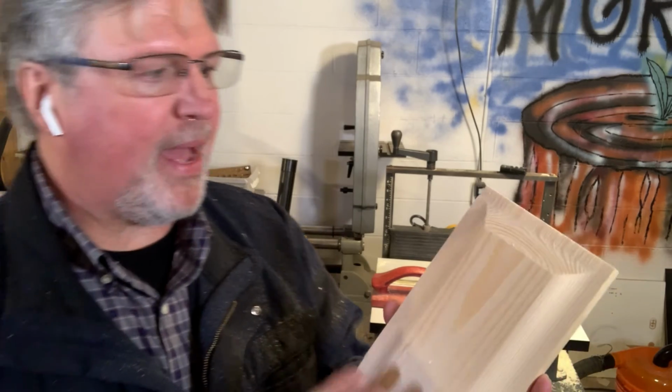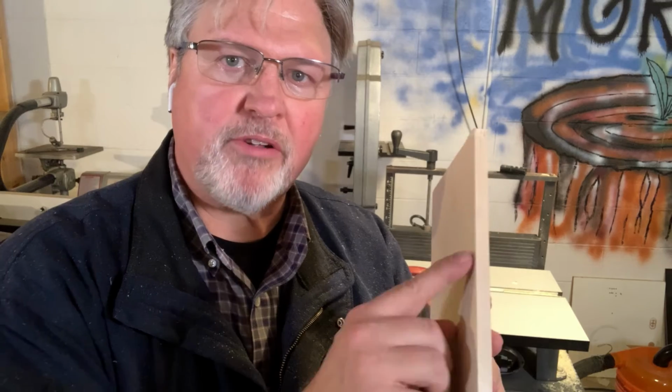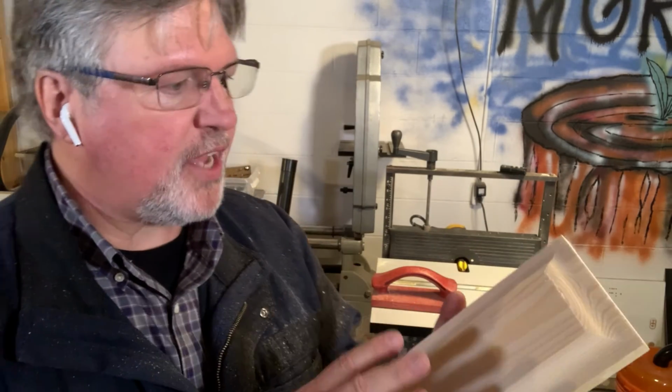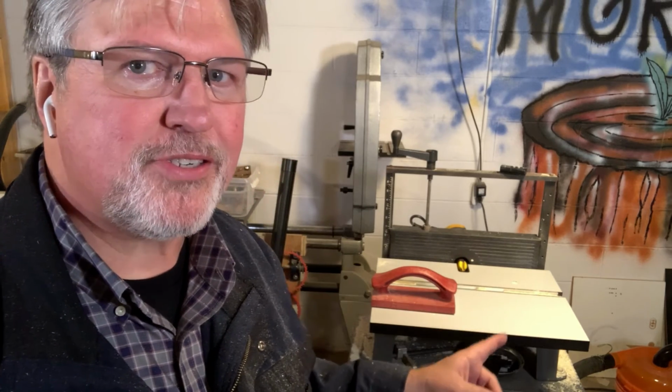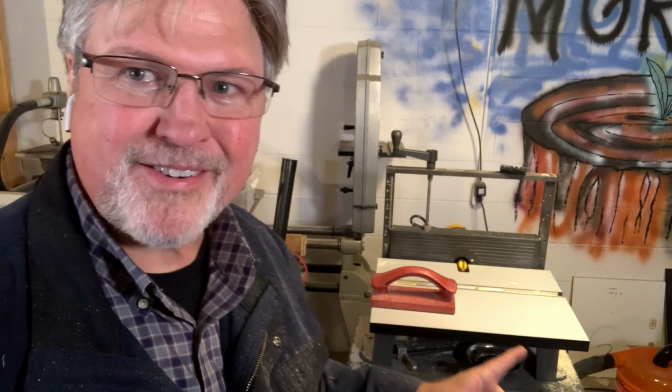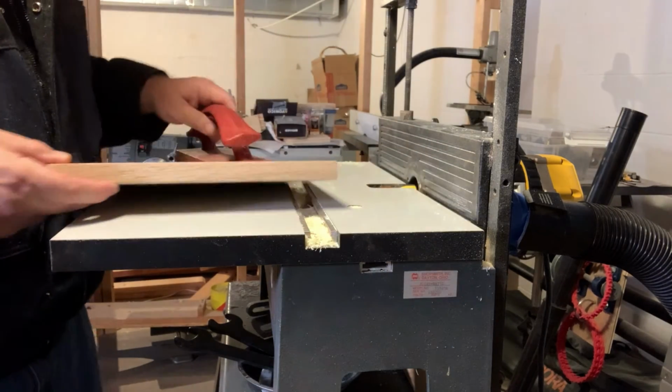of our door frame. If this is the shape I'm happy with, I can create a rabbet on the back of this panel just using a straight cutter, table saw, dado blade. But let's try this out with the oak. By the way, dust collection is horrible. I'm going to bypass the cyclone just to see if I can improve this because it's not right. All right, keep the red oak.